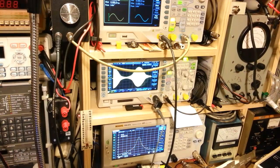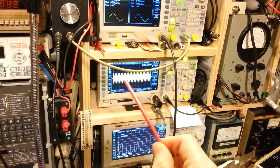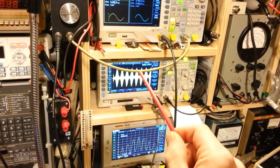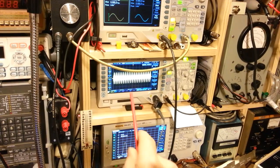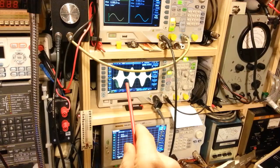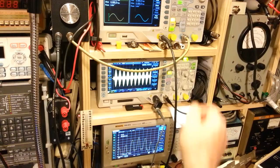But one thing you'll notice is how large that waveform is at the beginning, when it starts out at 10 hertz, and the farther out you get in the frequency, or the higher the frequency gets, you can also see down here on the spectrum analyzer, it starts to drop off. So it does ramp off. It's not a continuous power level. You can see the amplitude dropping as it sweeps through that frequency. But that's what it does.